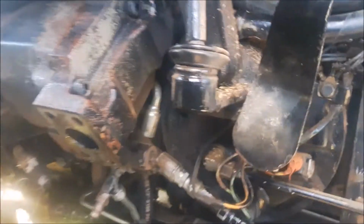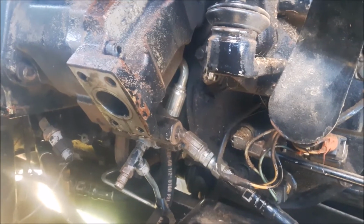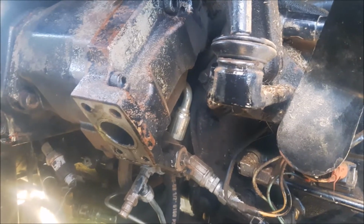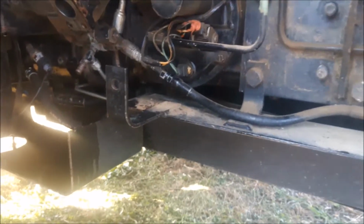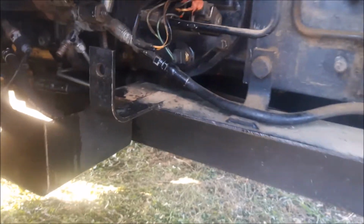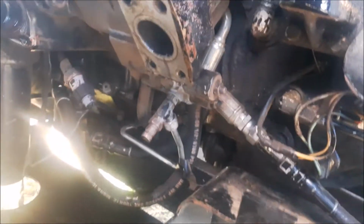Hey everyone, we're back at the Agco 9435. Just getting things geared up here to take the pump off. Right now I drained out 4 cans of fluid. It holds roughly 6, I guess. You need to do that because when I take this hose off here, it starts draining. So I've been through that before.